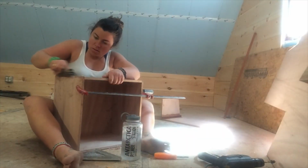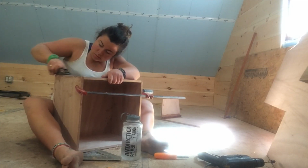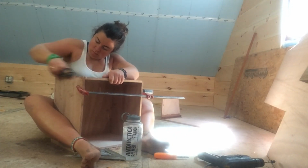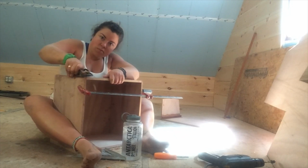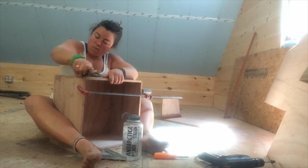I bought 2 new marine batteries and made a box for them out of 1/2-inch plywood, which I epoxy coated and then used fiberglass to reinforce the corners of. This I stuck under the quarter berth, and that is where both the batteries live, as opposed to when I first bought the boat when they were each in a separate place.